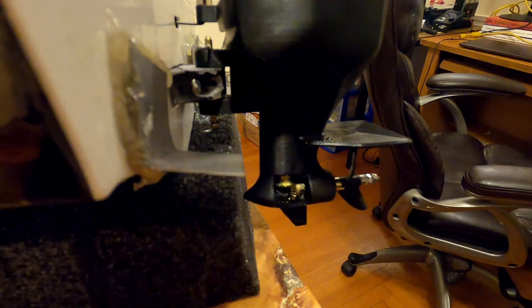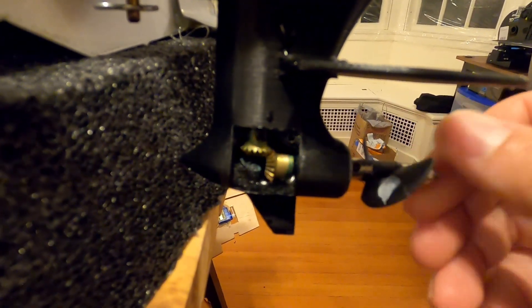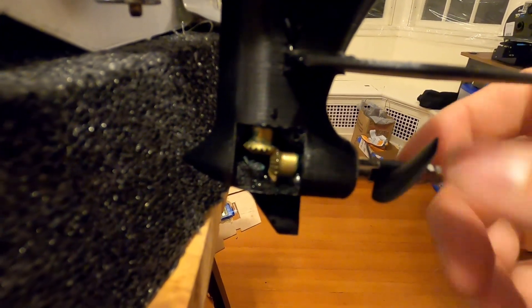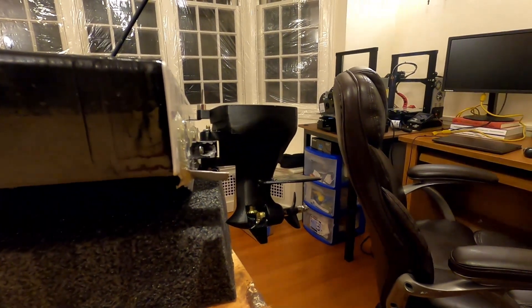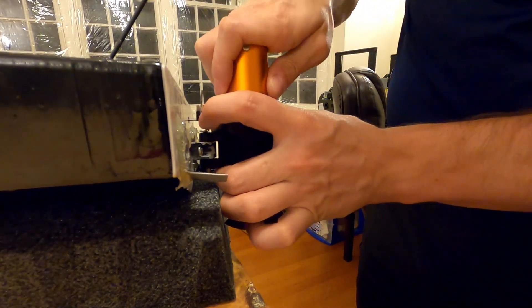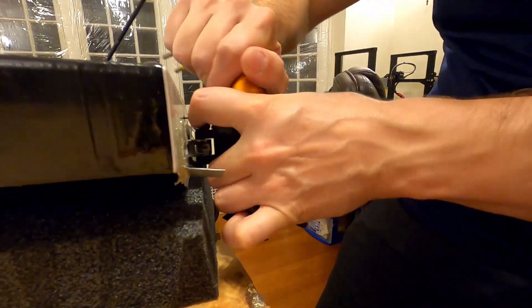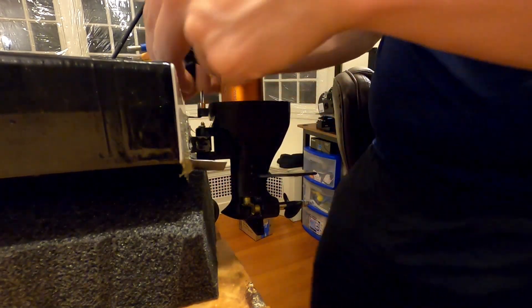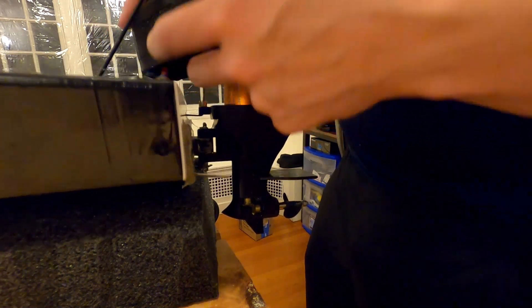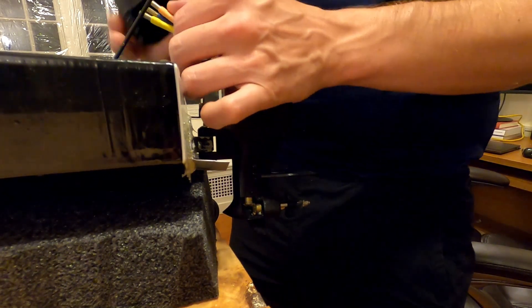I have a little screw that keeps this cover on so I can get at the gears. Right there you can see some very small precision-cut bevel gears I've gotten online. There's the horizontal shaft going up to where the motor coupler is. I'm running only a 32 millimeter diameter prop — I think it's a 1.4 inch pitch. The motor is just a friction fit inside the housing, so I align the couplers and press it in.